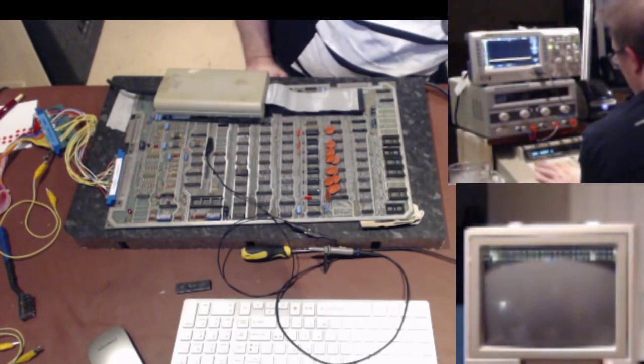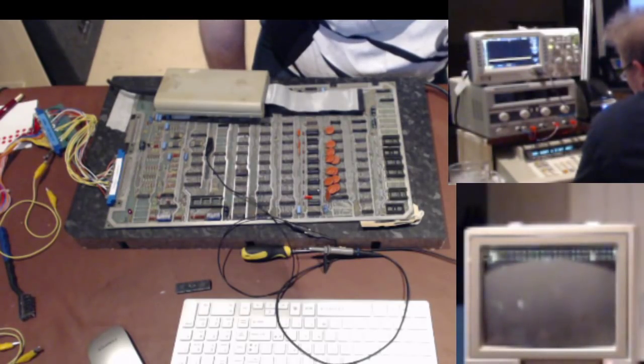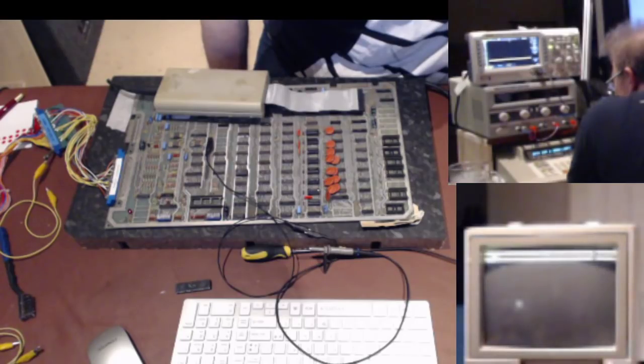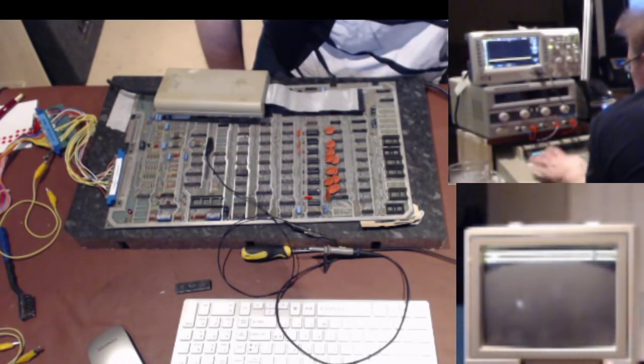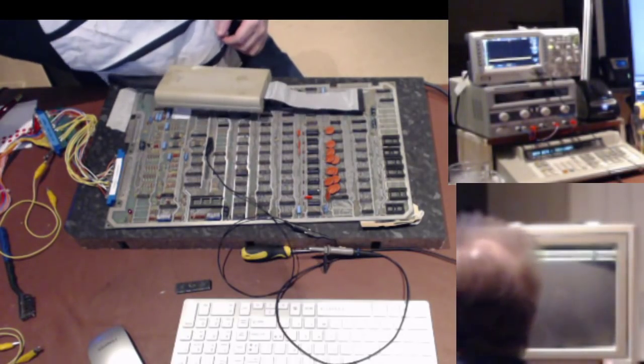We're never going to get a ROM test to work. So if I go 0 to 3FF, I very much doubt that a RAM test is going to work. It won't, because it's going to say data error at 0, because the bus test is failing. Right, okay. No option but to take some chips out of the board at this point.